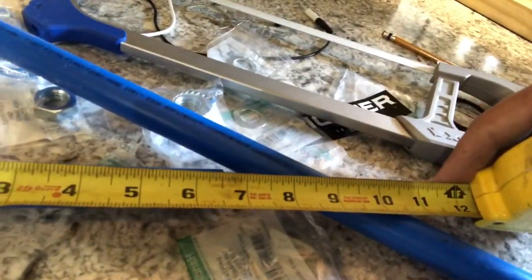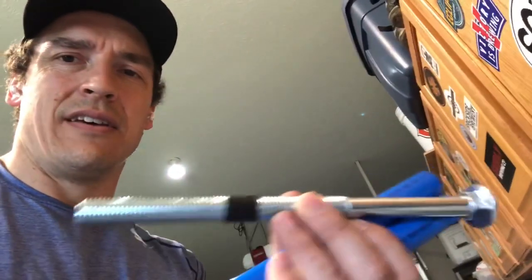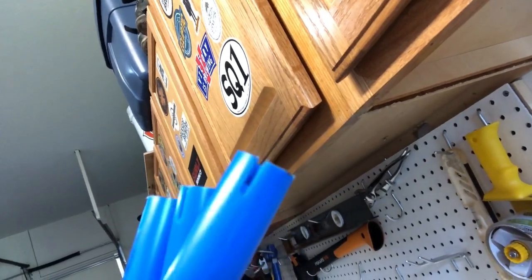So I measure it out and I just used this kind of a saw. Now I've got all these others cut to size - six and three quarters. You need these different sizes because even though this bolt is 10 inches, you have to have room to go through the upright. So then you got them all cut. You can see the little end there - in order for the pipe to fit over that, you have to cut some slots in the end. Now you can see I've cut four slots in the end so they can slip over the bolts.